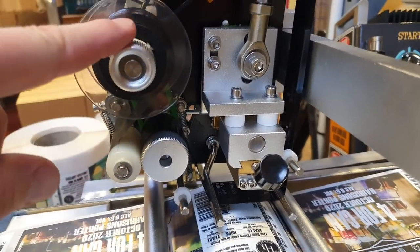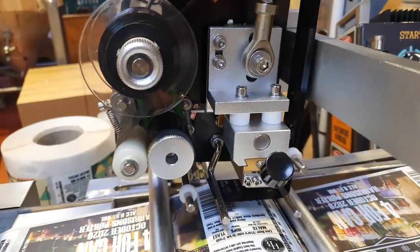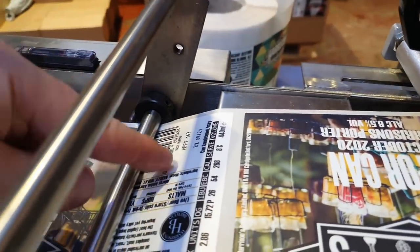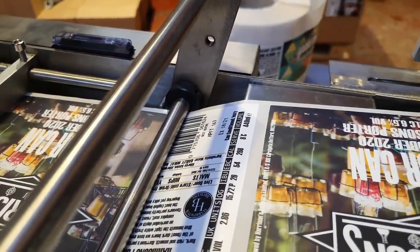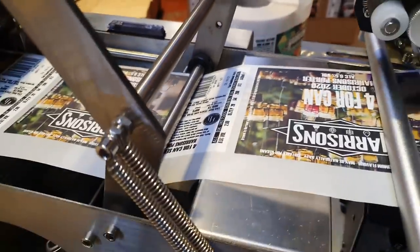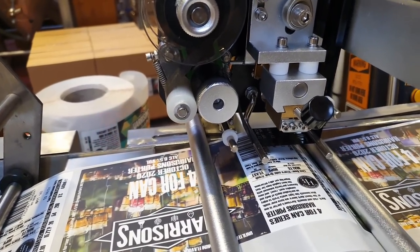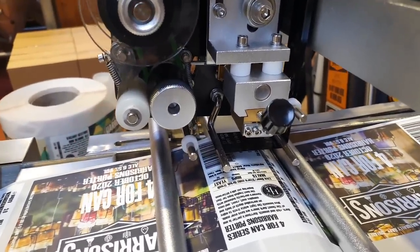And then this tape here, I believe, is wax. It's a wax backed tape. And then what you're doing is stamping the hot wax into whatever material you like. This happens to be polypropylene, works on paper, works on any slippery, shiny surfaces, which is why they use wax, and it basically stamps it on and it doesn't smudge, whereas ink might smudge or not dry or adhere to any of those glossy surfaces. So there you go,